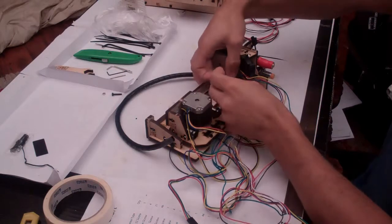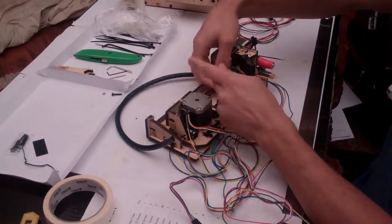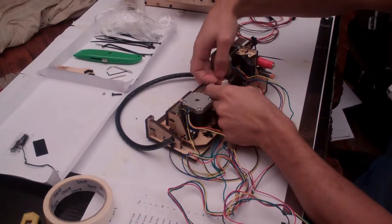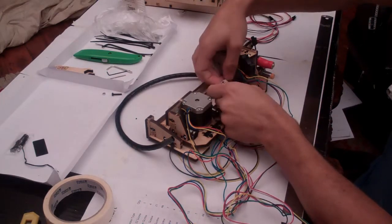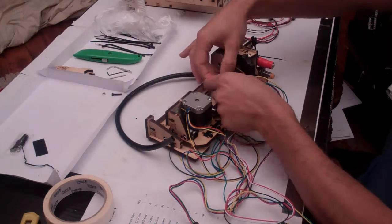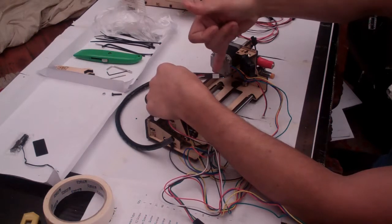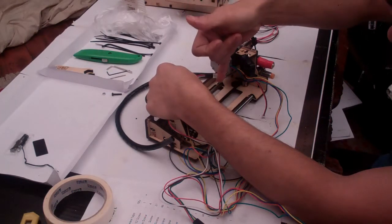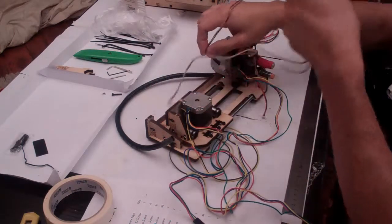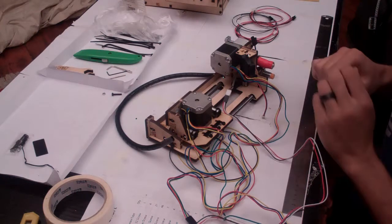If you've got black, brown and blue, then you simply match the colours up. If you've got the red, white and black, you need to make sure the red lines up with the black, and at the bottom the black lines up with the blue. Once connected, you'll have on this side at the top red, white, black, and this side from the top black, brown, blue. Once that's done, this cable's ready to put out the way and move on to the next cable.